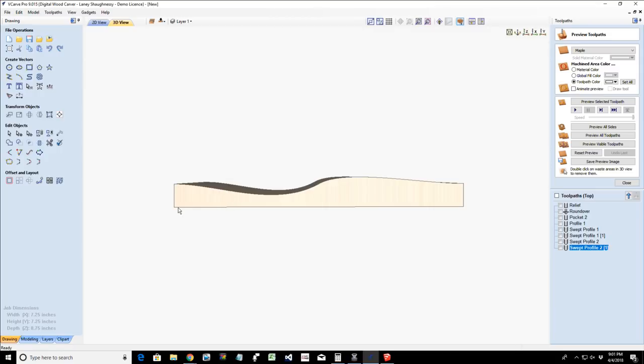And so let's say I had all this glued up. I had my maple or whatever veneered in this walnut, and I had another piece of walnut above that, sandwiched together, glued and clamped. And then on the two outside edges, I glued in a quarter inch piece of cherry on one edge and a quarter inch piece of cherry on the other. Well, when this ring cuts out, it's going to be banded on the outside edges with cherry. Then a nice thick strip of walnut with a little bit of a curve. And then a center band, a center line of whatever my veneer is here in the middle.